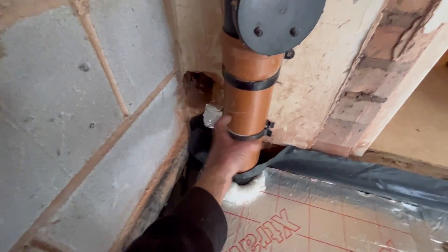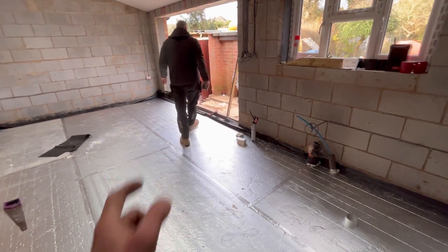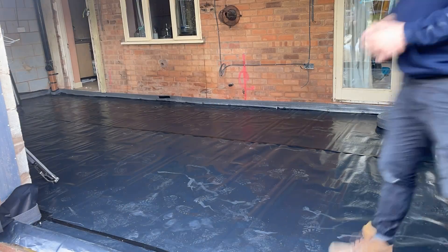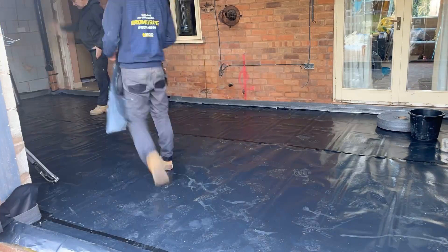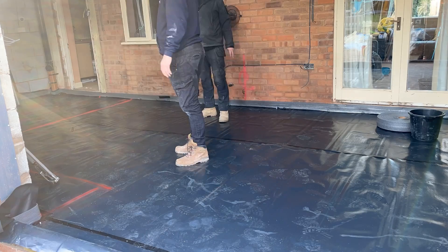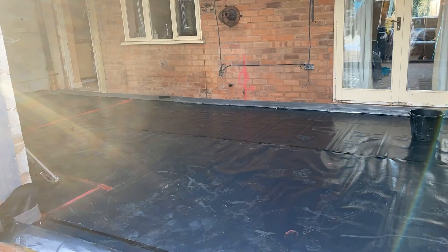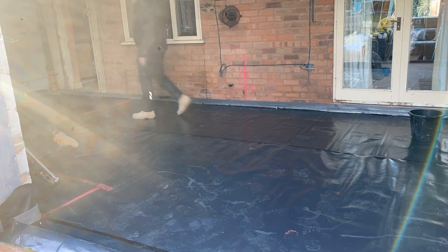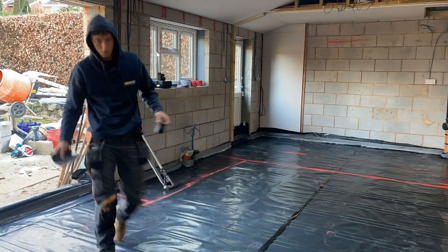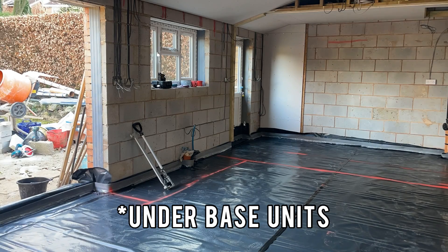That foam can get cut off. We've managed to spin this round into our waste, which is good. We'll get these last pieces cut, and the next footage you'll see in a couple of seconds is Michael on Monday after the weekend with the underfloor heating lads. What you can see now is the lads setting out the foam perimeter, which they put in so the screed doesn't touch directly against the wall. They've also marked out the kitchen area for the units so we don't put pipes under them — we don't want heat under units that have food in.